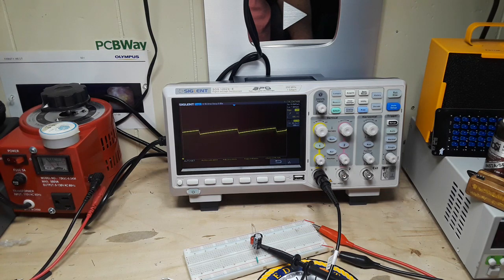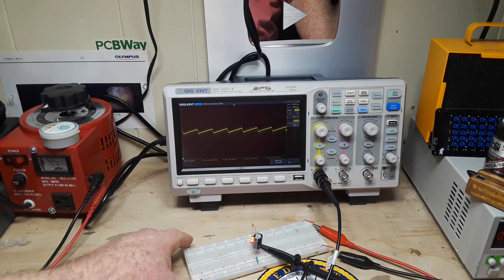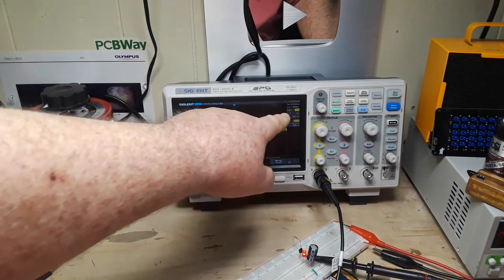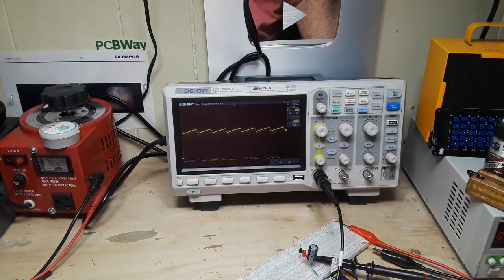And what's really interesting is the voltage. You have to have enough voltage to do that. And that's another kind of a why thing. So right now we're at 10 volts. Let me take this up to 12 volts. Now there we are at 12 volts. You can see the LED is blinking considerably faster. And of course now we're at what? What's our frequency? See, we're kind of flopping all over there.